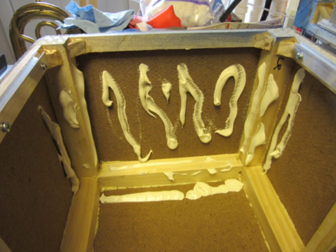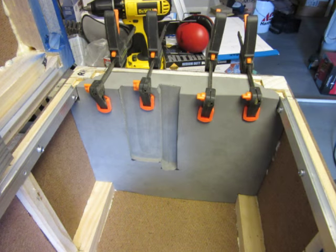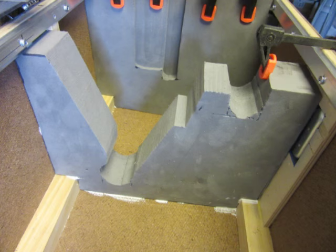Pretty much the best readily available adhesive I've found for closed cell polyethylene foam is good old liquid nails, just the regular stuff, not one of the special versions. Nothing really adheres to polyethylene, but this stuff works about as well as anything, and polyethylene foam is sometimes used in home insulation, and liquid nails is the recommended adhesive for attaching that to the wood structure. So, as in this case, that foam is mostly held in by close proximity to the wood frame of the house, and the liquid nails adhesive is really just there to give it a little extra grip.